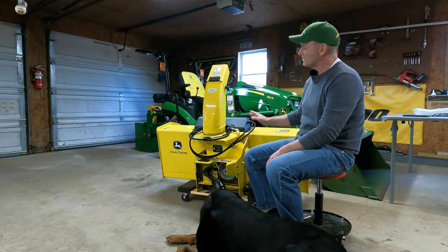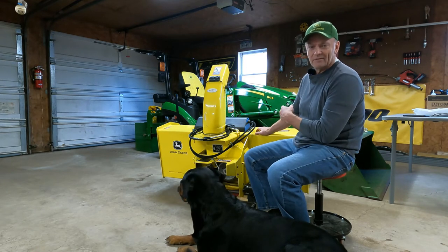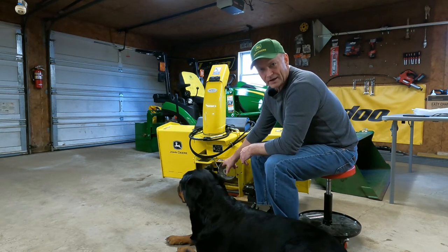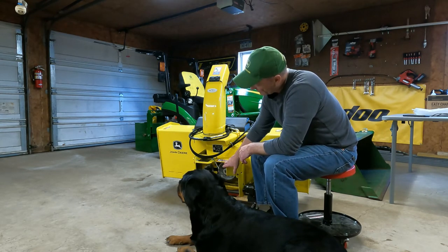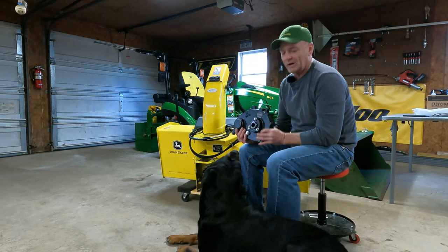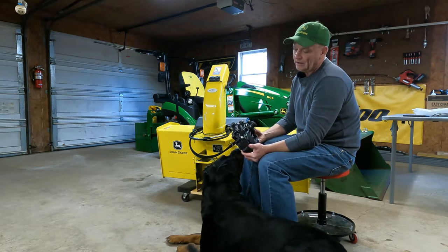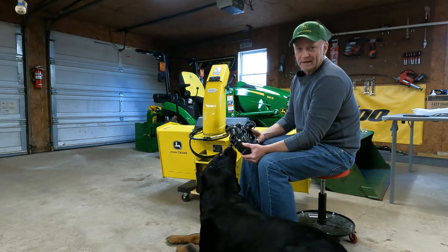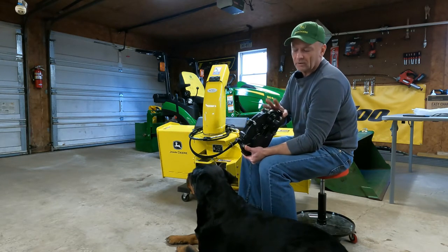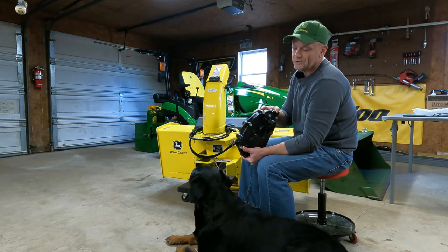And today we're going to take this 54-inch John Deere snowblower off my 1025R, and we're going to convert the open face chain and sprockets over to this parallel box, which is a sealed unit that runs in an 80 weight, 90 weight gear oil, so a lot less maintenance. And I'll put all the part numbers and everything in the description, plus I'll list all the part numbers up on the screen.